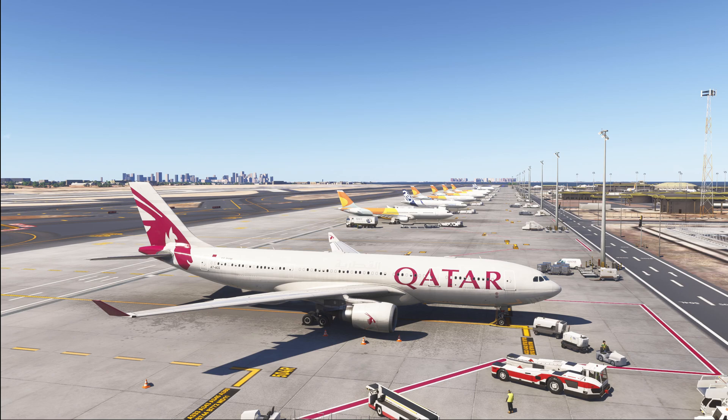The Enhanced features an increased maximum takeoff weight capability of approximately 10 additional tons. Combine this with a typical holiday carrier layout of the aircraft and you quickly end up with less cargo, an increased maximum takeoff weight, and therefore a sensible and useful use case for a center tank. However, the Enhanced only became available very late in the A330's production cycle, and older aircraft are typically not retrofitted as it would require enhancements to the landing gear and other structures.